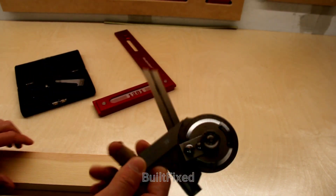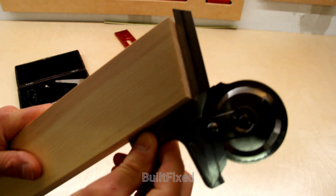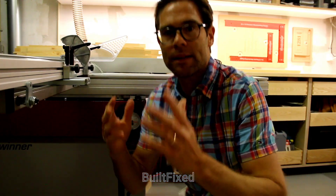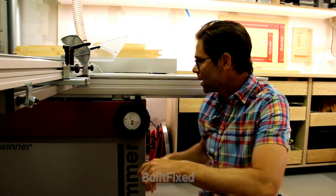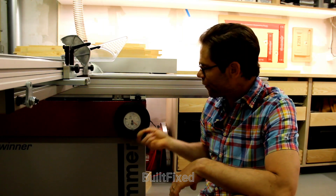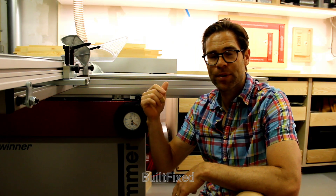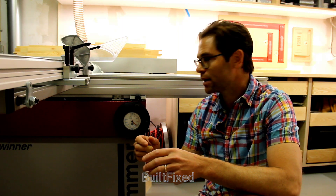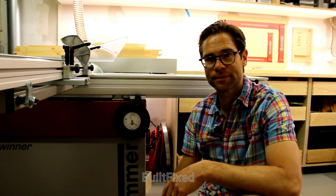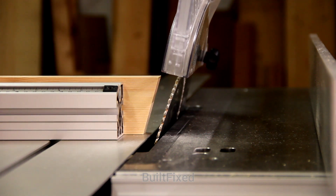All right, the gauge is now locked to 16.5. I'm sure you can't see the graduations on camera but take my word for it, and I don't see daylight between the gauge and the wood. Now there are two ways you can test something — you know, you have accuracy and you have precision. I've checked against the gauge; let's just see about some idea of precision. So if I were to move this angle now away from 16.5 and then come back to it again, recut my piece of wood and check it again — my Brown and Sharpe is locked at 16.5 — so even if it's not truly 16.5, we can now see: is this gauge precise enough to do something and repeat it over and over again? So let's try it out. All right, this is take two on 16.5 degrees.